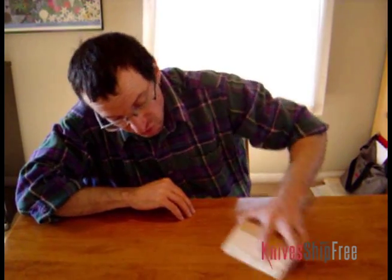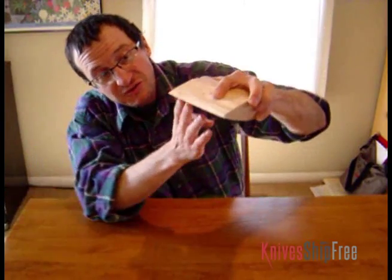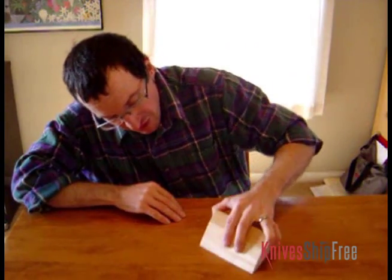Now to sharpen a beveled edge, it's just a series of flat surfaces. So historically people have always used stones by laying it on a flat surface, either doing it in circles or doing it away from them like that. And then to finish the secondary bevel, they'll tip it up and again just grind away until they create a flat surface. But how do you make a flat surface adapt to a continuously curved shape? And that brings in one of the challenges of sharpening a convex edge.